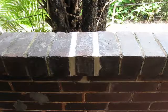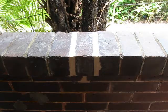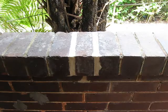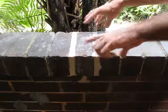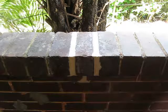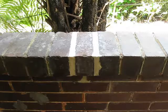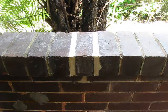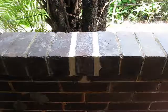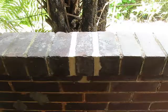There's the finished joint. I found it quite difficult to get the mortar to support in the outer regions because there's nothing underneath it — I began to think they might have used some sort of formwork. Towards the end I added just a little bit more sand to make the mortar firmer, but it was still very workable and it's all looking reasonably symmetrical. From what I understand, lime mortar takes a long time to set, and it's not a bad idea to keep it moist as it's setting. We'll give it a while and see how it goes, and if it's got enough strength we'll go over to repointing the joints. The brickwork will need cleaning up a little bit too — fingers crossed!